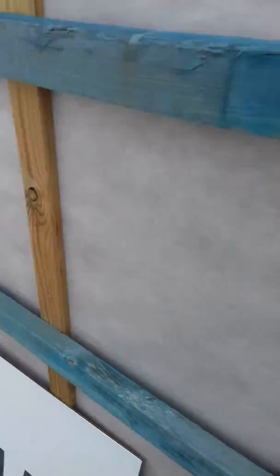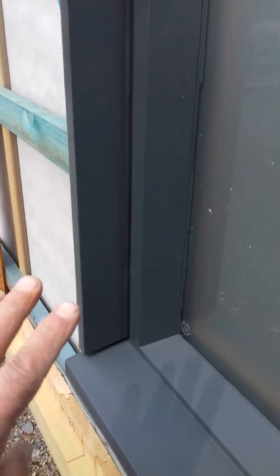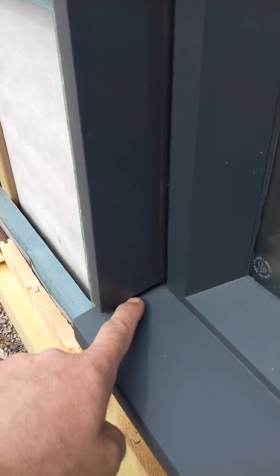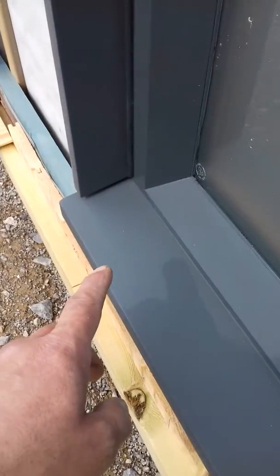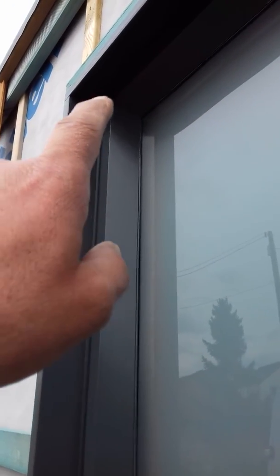Moving on to the door and window trim would be the next point. You want to fit those. Door and window trim is this here. We've painted these because we wanted to. 7mm gap minimum, sealed behind, stops capillary movement. Here you've got the EPDM edge seal running up through. Whatever gap and angle, so here, replace this up the top.